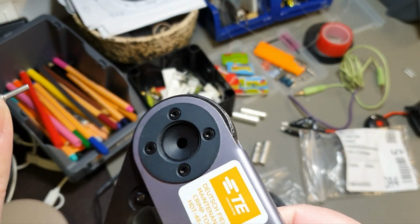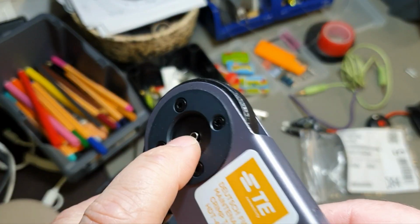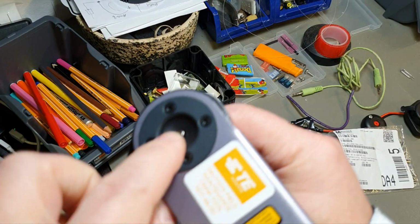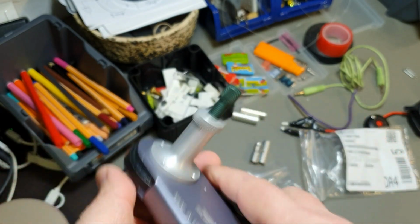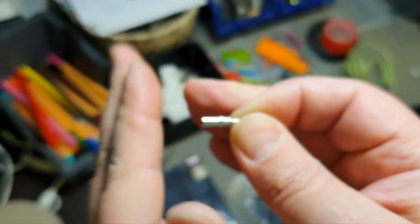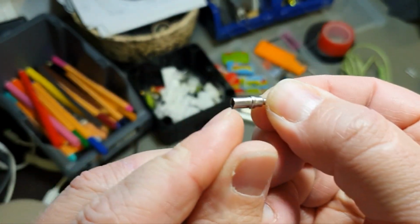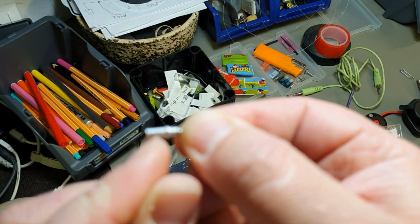So what was the mistake with crimping? Actually, when you adjust the tool, you need to push this contact there and then adjust on the right level, because when you do crimping, you push it with the wire, and if you adjusted it to be level with that surface without pushing it, and then you push it with the cable further, then the crimping area will be here, not in the middle.